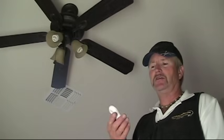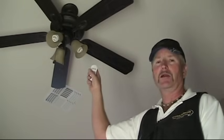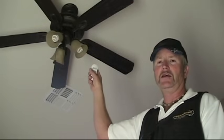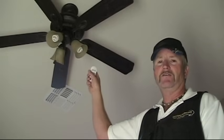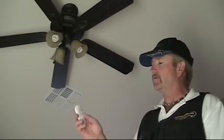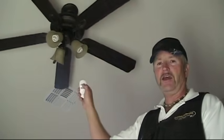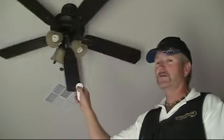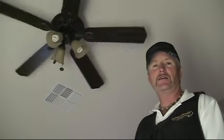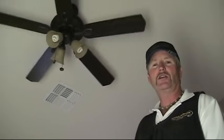With our master switch on, it's time to test out our system. You still have to have the pull chains in their correct position — the fan speed pull chain must be in either high, medium, or low speed. The reverse selector switch is still a manual function with this universal remote, and your pull chain for the light kit will have to be on. Testing out the light — that's on. Shut it off. Turn on the fan — and that works as well. Fan off. So everything works. Thanks for tuning in to this edition of Current Topics at electrical-online.com. I'm Terry Peterman, the Internet Electrician, and thanks for watching.